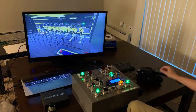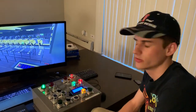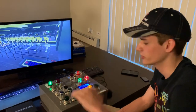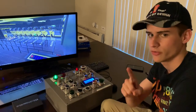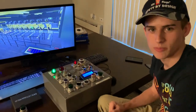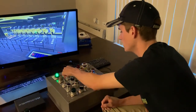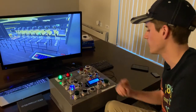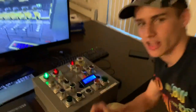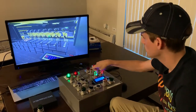Alright, so we're now in control. The operations type key switch determines what coaster you're running, because not all coasters have floors or chassis. We're going to go ahead and put it into type two. However, you can't change the type while the ride is in operation — and that's why we got a trouble light here, a trouble light with an alarm, very serious. We'll silence the alarm, switch to manual mode, and the screen tells me we have error 161: ops type changed while active. Acknowledge to continue, then press trouble reset. Boom, and we're back.